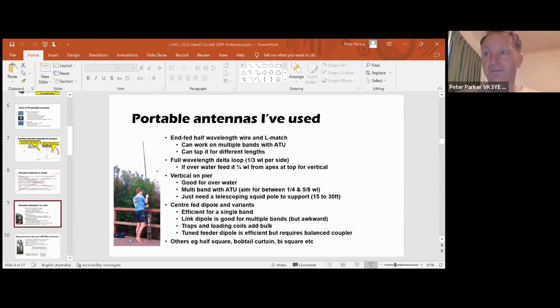As far as portable antennas I've used - quite a few. If I had just one and wanted a wide variety of contacts on several bands, I'd go for just an EFED half-wavelength on a band like 7 MHz with an L-match antenna coupler. Even that can work well on multiple bands - like on 14 MHz it can work as an EFED inverted-V, if you feed it with just one tall pole in the middle, and that can give you a bit of radiation broadside, a little bit of gain. A full wavelength delta loop is a good single-band antenna, with a third of a wavelength per side.